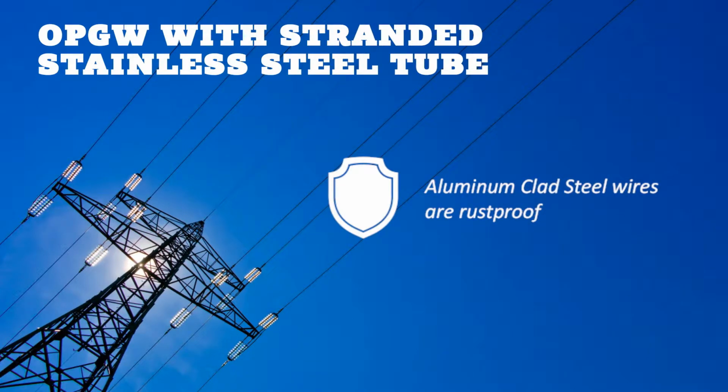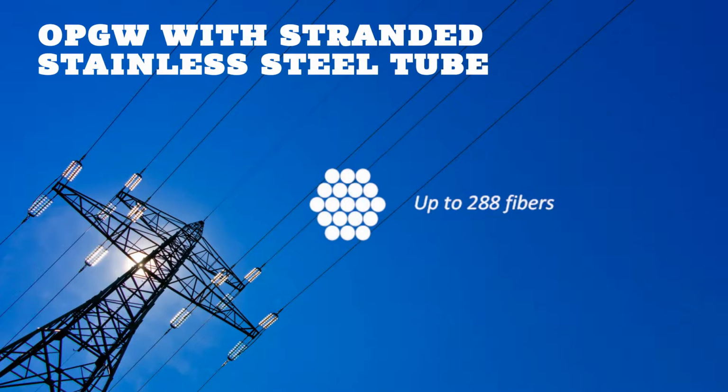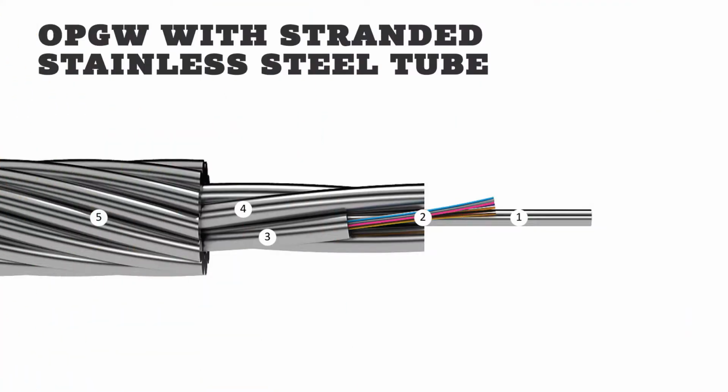OPGW with stranded stainless steel tube is highly resistant to corrosion and short-circuit currents. It may contain up to 288 optical fibers. Let's take a look at the cable design.